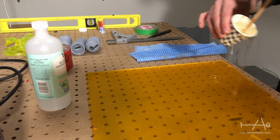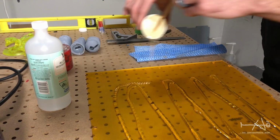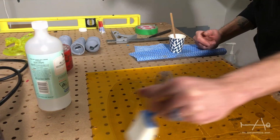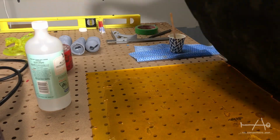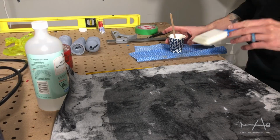The resin quantity is up to you. We have these little cups for mixing, and for the area we need to cover, 2 of them seem to be enough. On the other hand, the textured side needs a bit more than a little cup. Too much of it will result in poor uniformity of the textured pattern, but not enough will cause dry spots and probably result in peeling of the fabric. The quantity may vary depending on the area to cover and the thickness of your fabric.